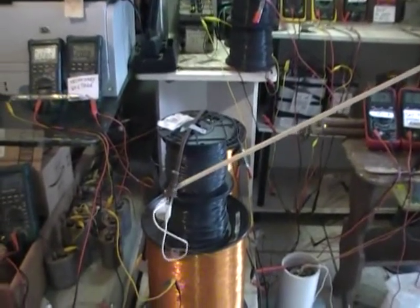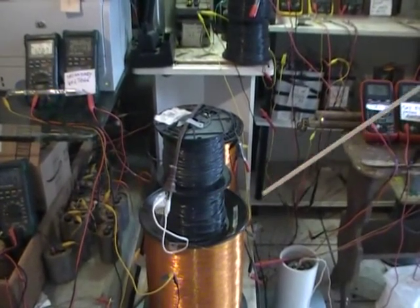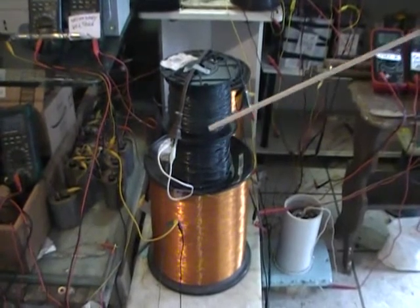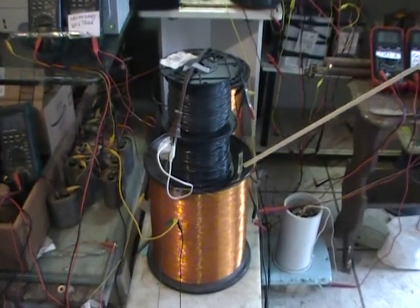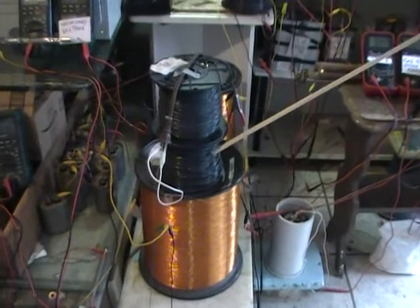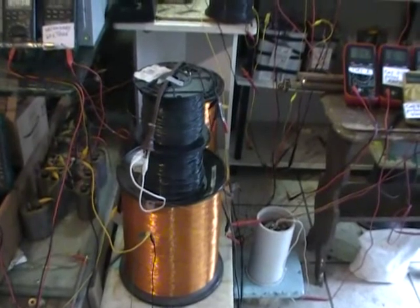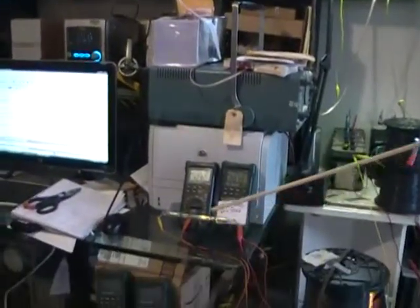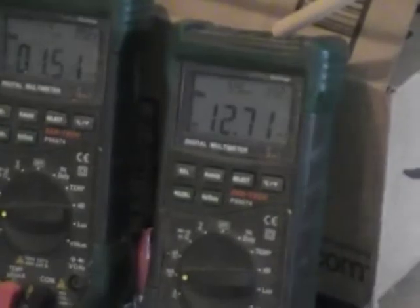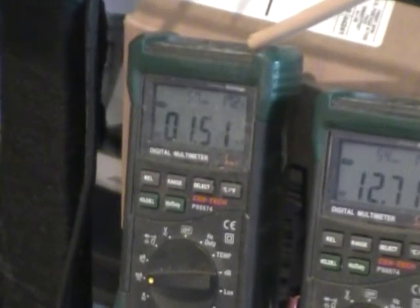This is the plug that would enable this system to work if it was line driven. In this situation, because the system is obtaining all of its power through the air through one of these coils, we see that to show the differences in how the bottom coil system will respond as a dual coil system versus what would be expected as a single coil system, when we in fact do have the short across the plug. We'll have to go back over here and look at our metering, at the front meter. The front meter is showing 12.7 milliamps and the back coil meter is showing practically nothing.